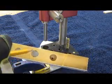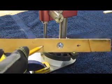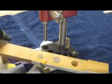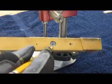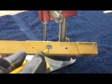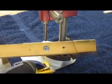But if you punch the key out in this direction, you're going to split the wood, for sure, coming out this way. Now, notice another thing. Many old Steinways have a little tiny punch hole, or drill hole, that is the center of the lead that's on the other side. So what I did, since I want to punch the large lead out from this side, is I took it over to the drill press and ran a half-inch Forstner bit just enough to expose the lead on this side. Now it's an easy matter just to punch this out in the proper direction without splitting the wood on either side.